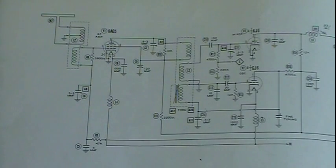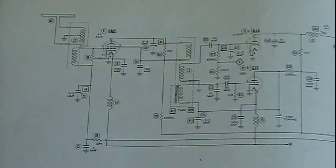And I've talked about this before, there's four primary signals that come out of the mixer. One is the radio station, untouched, unbothered. That frequency comes out. The local oscillator frequency comes out, unbothered, not mixed with anything. Then you have the two added together, and then you have the difference. Along with that, you're going to get a whole bunch of harmonic frequencies also as well.